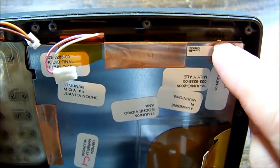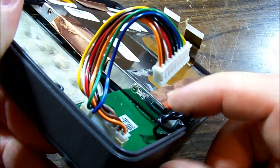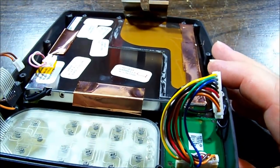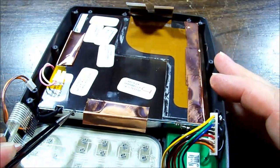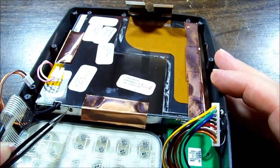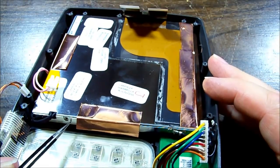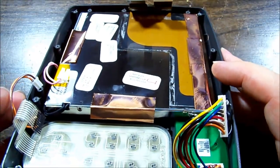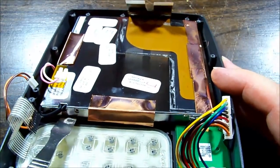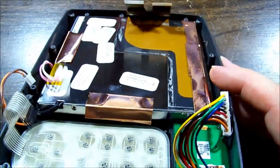Now if you look carefully, there's clips all the way around the side. We have one screw in this side for the earth cable, but everything else is clipped, and the lower section is wider than the other section, so this is sitting inside this metal frame. We should probably pull this out and leave the frame stuck to the glass, and that would save a whole lot of headaches. Because if you start getting in there and prying and twisting and trying to dig out the tape and whatnot, you're going to end up cracking the LCD, guaranteed. Or the front glass if you're totally unlucky.